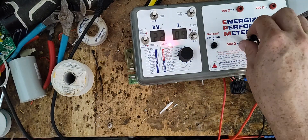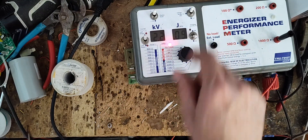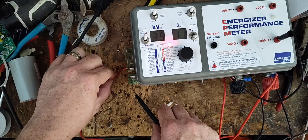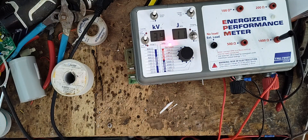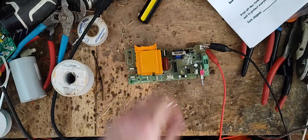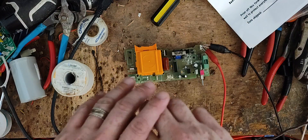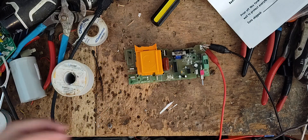If we go to a 200-ohm load we'd just kill it because we're already below 3 kV. Let's put a 1000-ohm load on and see if it's any higher — probably not, we'll try and see. Yeah, we're at 0.11 joule output. So stored joule is 0.17 and output joule is 0.11. It ain't a whole lot, but put your fingers across there and let it spark to you — your body is not going to be able to hold it. It'll feel like a little jolt through both arms. It won't hurt terribly, but psychologically you're not going to like it.